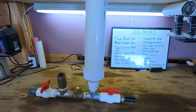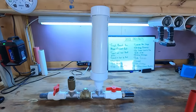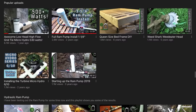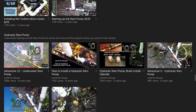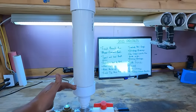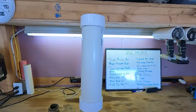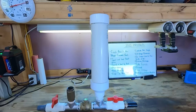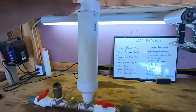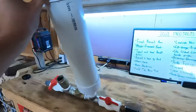Now, when it comes to ram pumps, I am no expert. There's a gentleman on YouTube named Seth who has a channel called Land to House. He has dedicated a lot of time and videos to hydraulic ram pumps, testing them in every different circumstance. From what he has said, these pressure tanks are going to waterlog — there's nothing you can do to avoid that — but typically you can get five to six months out of them before they get waterlogged and you need to drain them to start over. But when it tips over, that obviously expedites the waterlogging of your pressure tank.